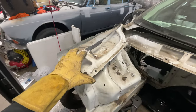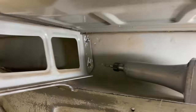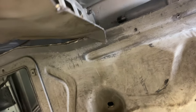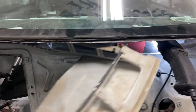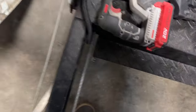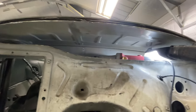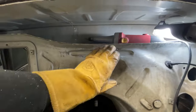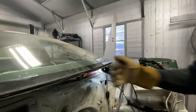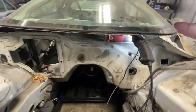We got one half out — that one wasn't too bad. But there is an inner structure in here, so we're actually going to try to drill out and remove those two little spot welds in the back, and then this whole piece with the bracing should come out. Almost — it's hanging in there on just one little tiny spot. Now we got all the room for activities up in there. We'll figure out how to clean it up and paint it back, but now we can put an intake that goes all the way to the back, and working on heads and the intake will be so much easier. We also ditched all that weight.